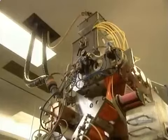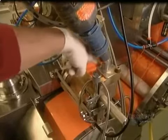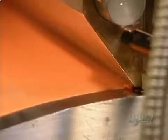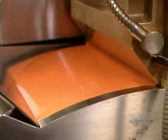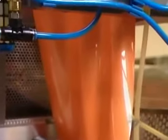Here, the vats of gel and fill feed a capsulation machine one floor below. This machine is the same kind used to make bath beads and gel cap medicine. First, the machine spreads out the gel onto a cool drum. This creates a continuous thin sheet of gel called a gel ribbon. This cooling cures the gelatin to the point where it can now be molded into the hollow shell of the ball.